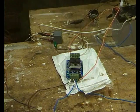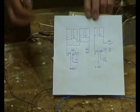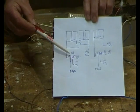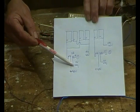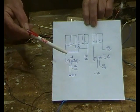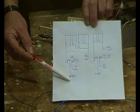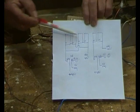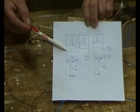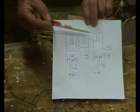There's a relay here operating that relay there — that's the power relay, up to 70 amps. The positive output from the timer relay comes along to the coil of that gray relay and then down to negative. When power is coming through from the timer, it's on, so those contacts are closed and the power from the panels goes through to the battery. These are normal 24 volt panels for a 48 volt system — two in series, two in series, in parallel.